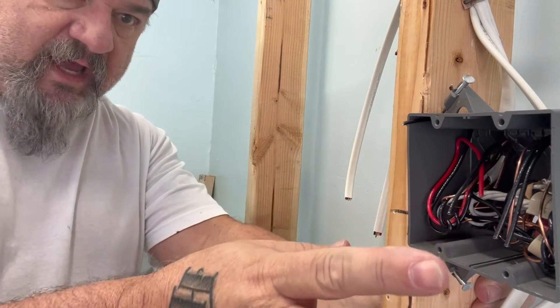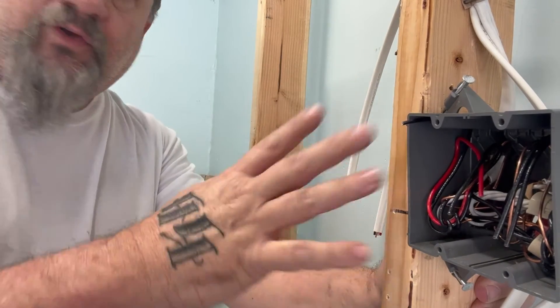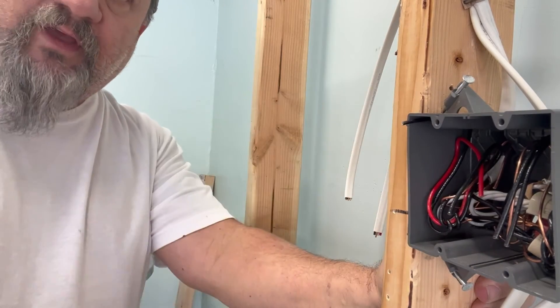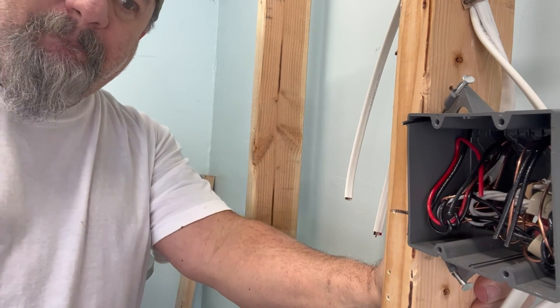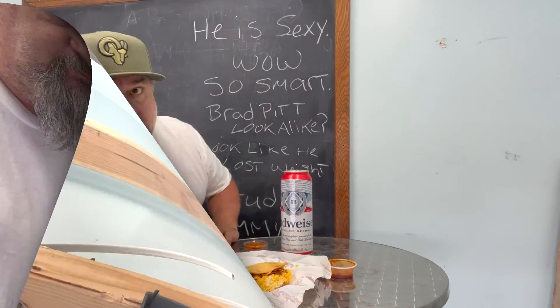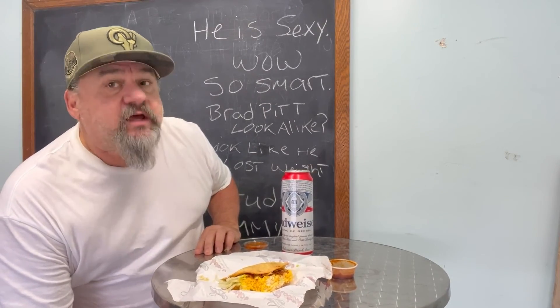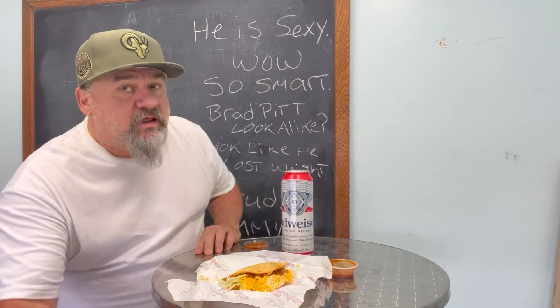And there you are — you have a made-up two-gang box for a three-way and a single pole switch, simple as that. Remember on the three-way, the other side has a switch leg, so you do the same thing but with the switch leg on the other side. Remember we're talking about importance — what's the final thing we do? You know what time it is — it's taco time! Smash that like button, subscribe, thanks for watching.